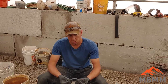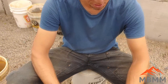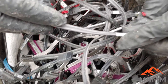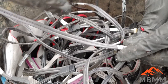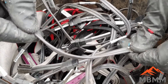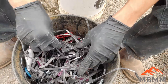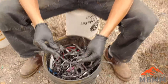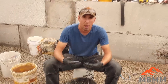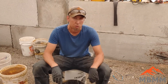We tried running some of these wires through the system and it turns out the insulation is so heavy and rubbery that the hammer mill doesn't really chop — it's more of a grinder and a breaker. The insulation on this was just too thick, and once it ground up it just never came out through the screen. For this stuff you probably need a granulator, whereas the ribbon cable went really well — the plastic was malleable enough and soft enough that it could rip, shred, break up, and come through the screen.